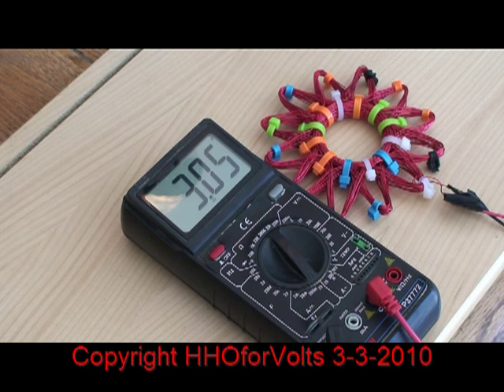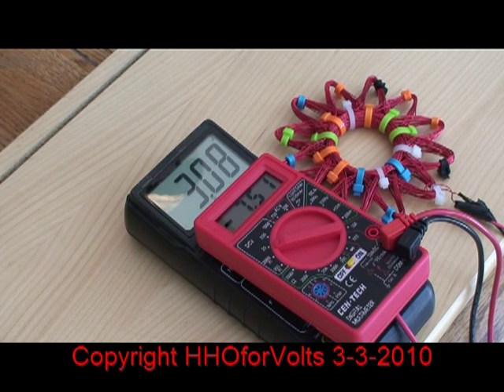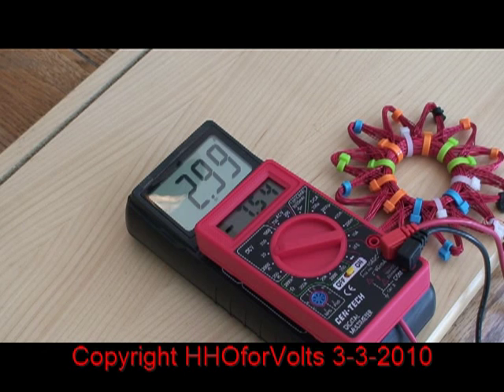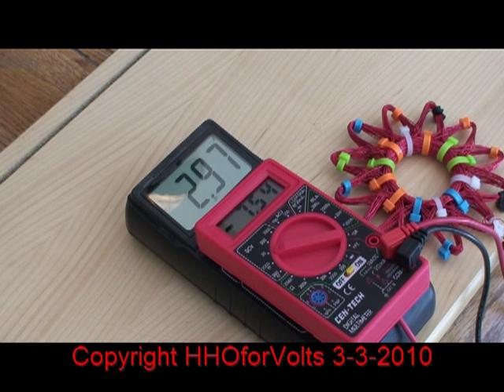For this test the mono Starship coil is drawing just over 3 amps. The voltage has dropped down to 7.51 volts from the unloaded 13 volts, and we have 3.06 amps. So that's going to come out to about 25 watts. If you think about that, it doesn't make sense because the transformer is rated at 13 volts at 1 amp — that would be like 13 watts — and this is showing close to 25. So between 21 and 25 watts. Very interesting.